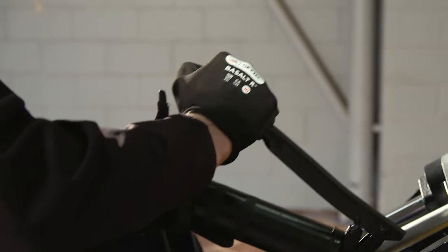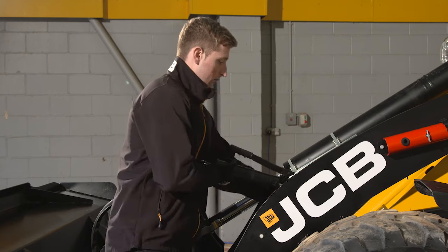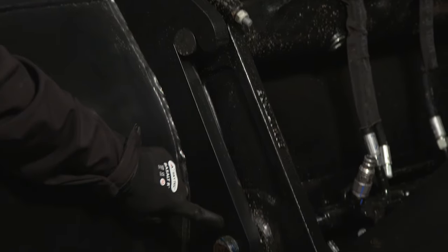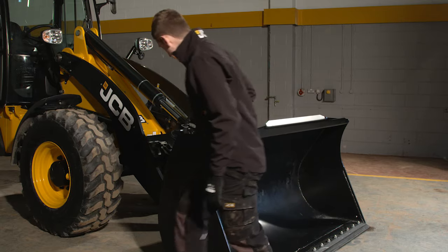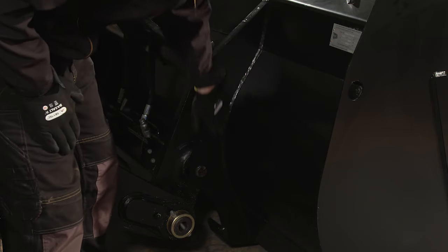It's recommended you wear gloves when greasing the machine, as grease from your hands could later be transferred to the machine's controls, resulting in unsafe operation. This machine is fitted with a quick hitch — always check the attachment pickup points and pin locking mechanism is secure. Check the toe plate of the attachment for any signs of damage. Look out for signs of uneven wear as this could indicate low tyre pressure on one side of the machine.